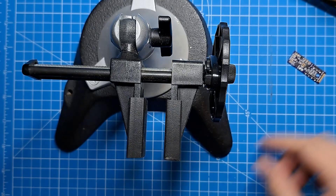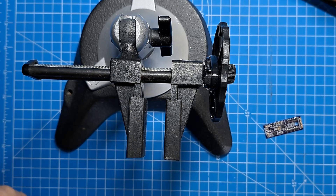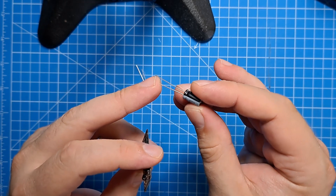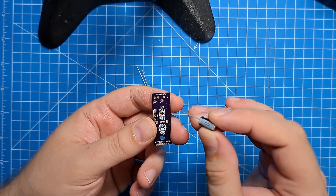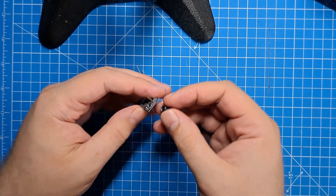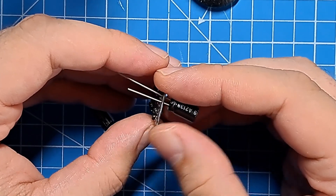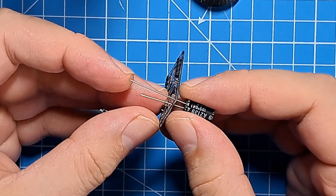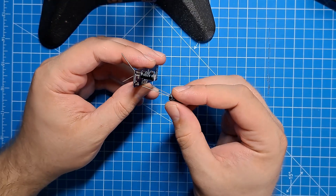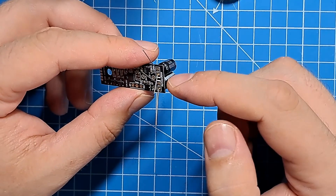We've got the PCB and it's just about finished — there's one more step but our time with the microscope is over. One more thing to go: the electrolytic capacitors that go at C7 and C1 down at the bottom here. I've brought out the vise to make my life a little easier. The electrolytic capacitors have two leads — one is longer than the other; the longer one is positive, the shorter one is negative. There's also a stripe on the negative lead. The negative side has to go towards the center of the PCB. I want to leave about a centimeter — a little less than a centimeter — of lead below the PCB, so I'm just going to bend those leads on the top side out so the capacitor stays where it is.